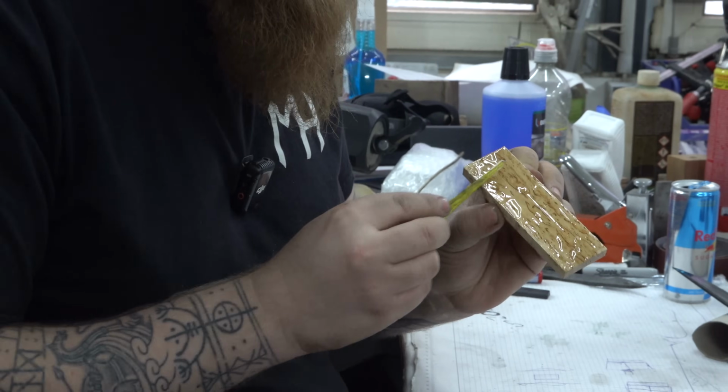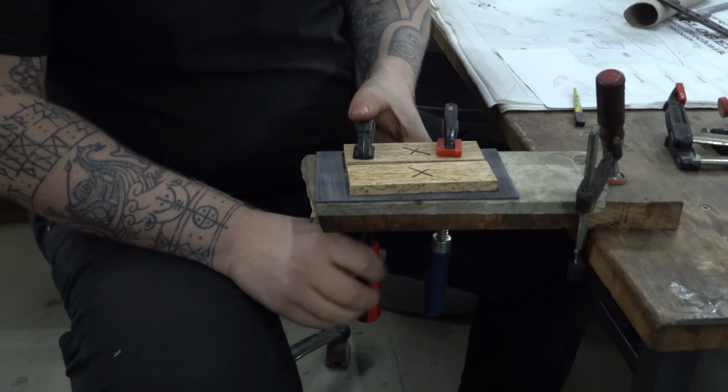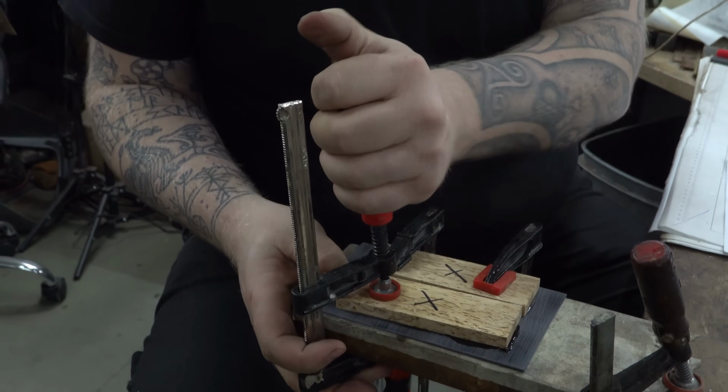But you could see what Chris did for the etching. He first put it into the ferric chloride, and then he put it into the gator piss. So ferric chloride is what we use for deep etching, and then the gator piss to darken it a little bit. So the etching looks actually pretty nice. Chris did a good job. I did a good job. And yeah, now it's time to prep everything for the handle.